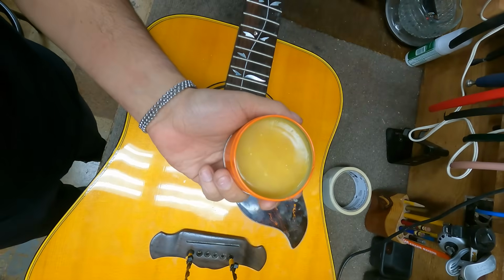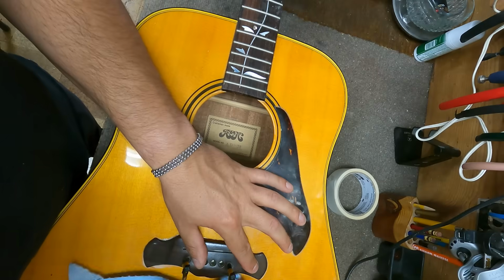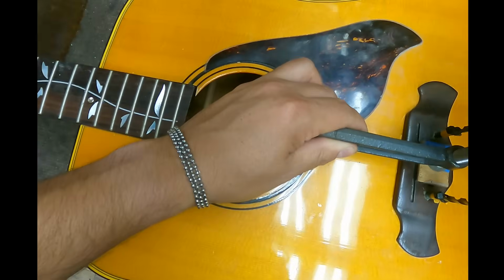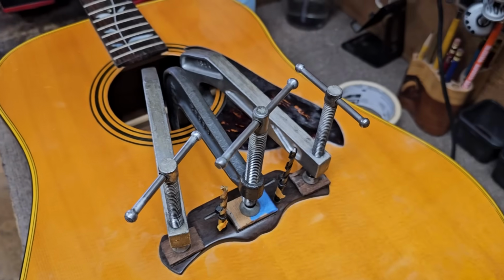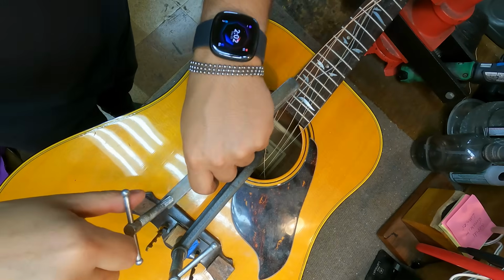And I'm using Murray's. I usually use it on my hair, well, sometimes when I'm out of the water soluble stuff, but I'm using it to grease those drill bits I'm using as locating pins. And if you've ever used that stuff on your hair, you know it takes like 2 weeks to wash out. If you do want to wash it out, you got to use like dishwashing soap. Strong stuff, but it helps the glue not to stick to those pins.